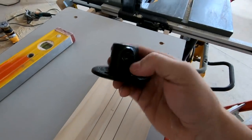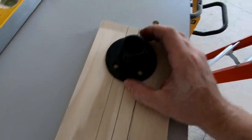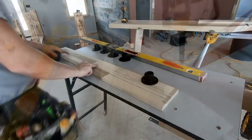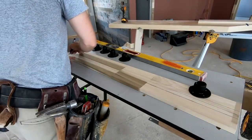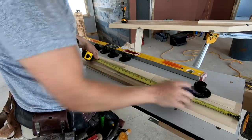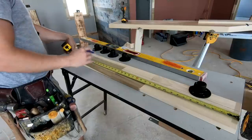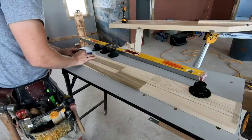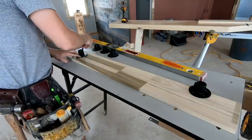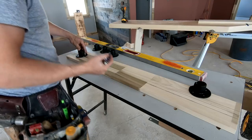So now you can see I'll put my set screw face down and I can then center the brackets so the holes are where they need to be. From here I'm going to mark the top of my jig, label it top, and I want to go about 37 inches to the top of my pipe handrail. I'll set that on there and this would be the location of my first bracket. I'm going to mark those holes just like so.